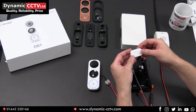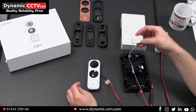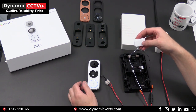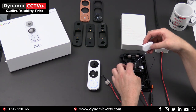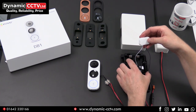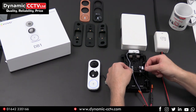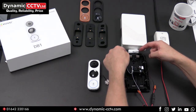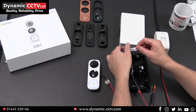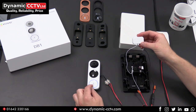Now, this little device here is the power kit — it comes with the DB1. When you press the doorbell, there is a sudden inrush of current which causes the solenoids to energise and hit the chime panels. The power kit wires in parallel across the solenoid. You can see the solenoid across here, with the power kit wired in parallel across it and then on into the doorbell. This power kit acts as a dampener against too much inrush current for when the doorbell is pressed.